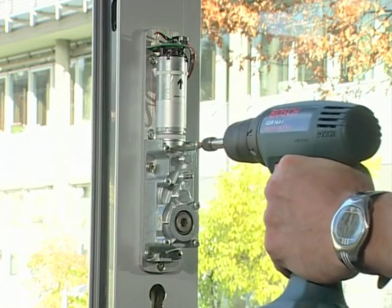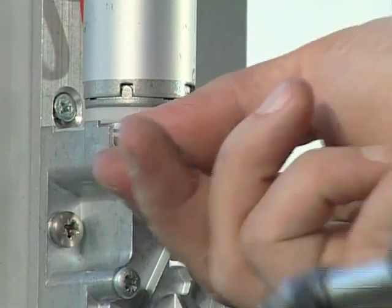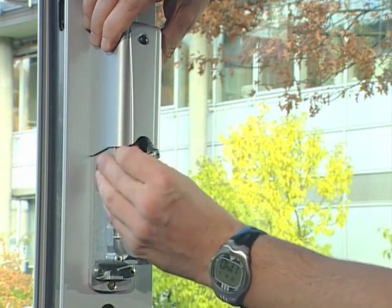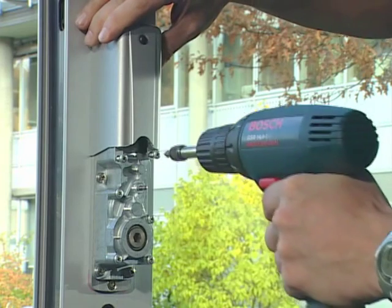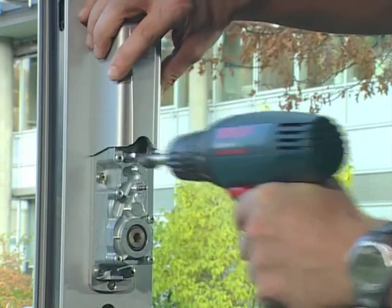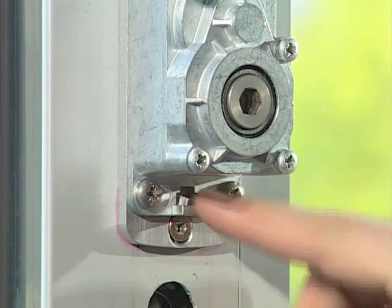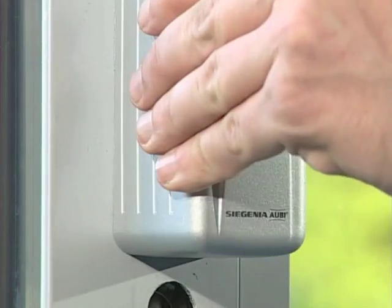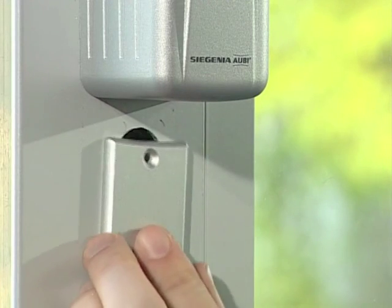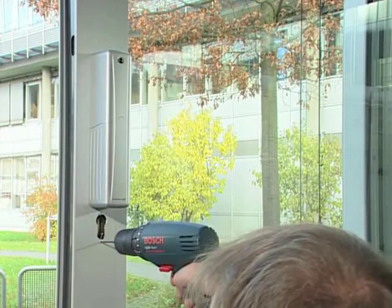The top cover for the lift drive is fixed with the two top screws. To fix the bottom cover, first place a square nut into the bottom bracket. Then screw the bottom cap firmly onto the drive unit. Visible profile cylinder milling can be covered with the cover rose supplied. If the lock is still to be used, please use the lock rose supplied.